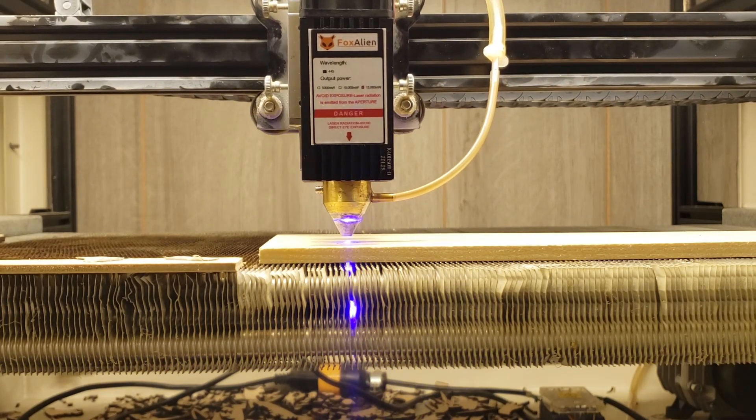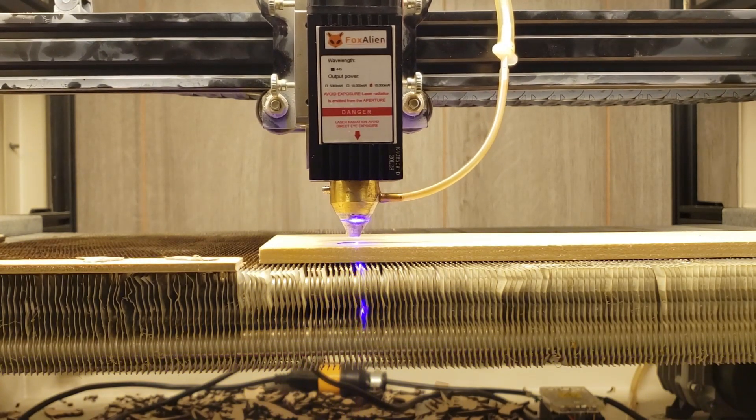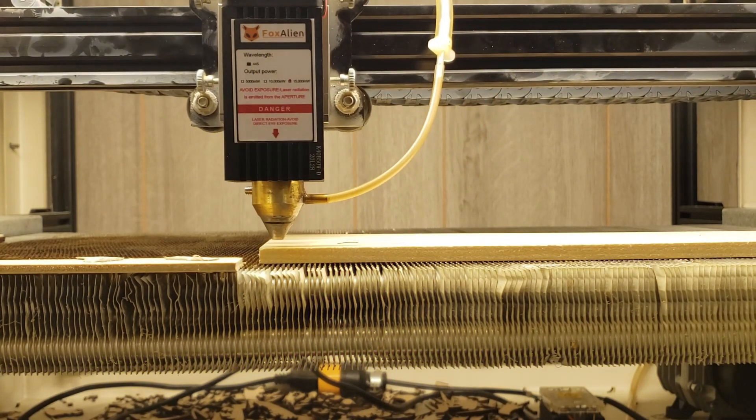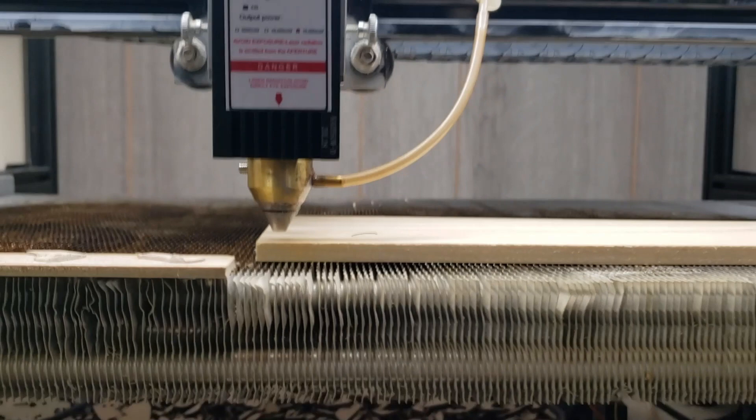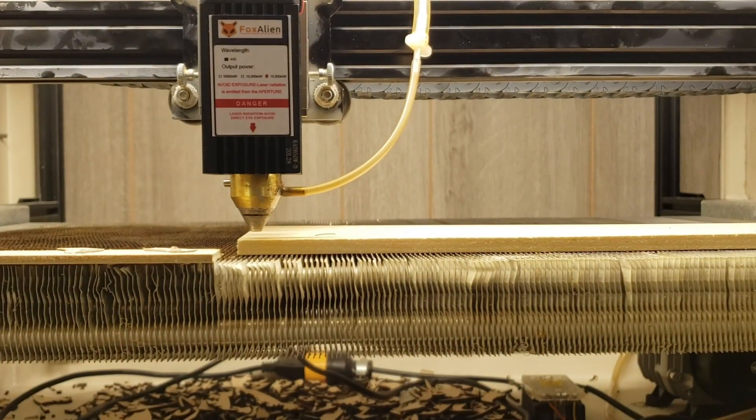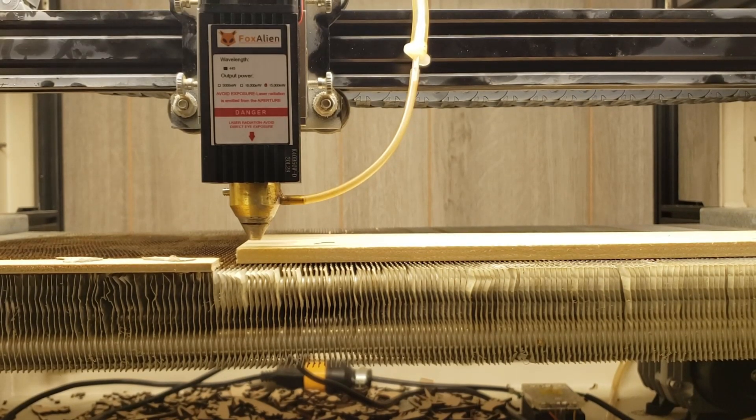That's number six and it just fell through! I'm gonna set it to seven passes. It fell right through, so I'll set it to seven passes and run the rest of the design. I always like to give it one extra pass beyond what cuts through, because sometimes there'll be a thicker grain somewhere and I'd rather give the laser beam a little extra time than have to fiddle with a razor blade on the backside trying to cut through. Cutting the rest of it's gonna take about four and a half minutes.